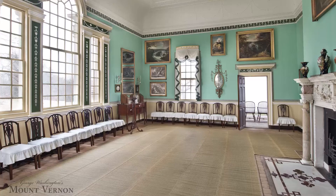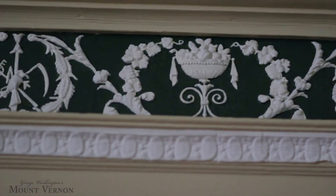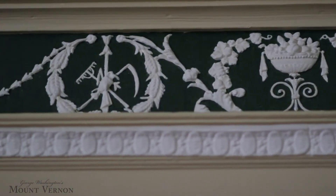These three colors come together to bring the room together in a very neoclassical way. These colors highlight some decoration used in the room — a very cutting-edge technology for 1787 known as composition ornament. You see it around the door frames and window frames, on the chair rail and baseboard, and on the panels of the Palladian window. This composition was a putty pressed into molds to create very detailed ornament that was then glued to the surfaces.